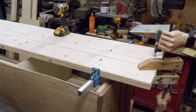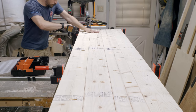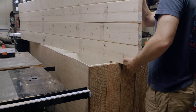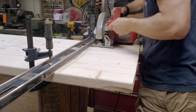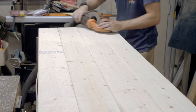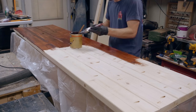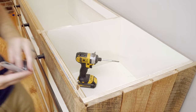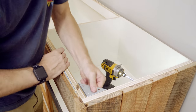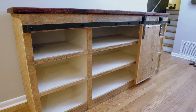Ultimately, this is not going to be a perfectly flat top. You could plane it down or use a different joinery method if that's important to you. Once I got all the pocket screws in, I used a straight edge on one end to trim it to the right length with the circular saw. I sanded both sides and the ends with 120-grit paper to get it ready for stain. Finally, I added a corner bracket to each of the four corners, flush with the top edge. They can permanently attach the top once it's in its final location, but for now they can lift it off so it's easier to move.